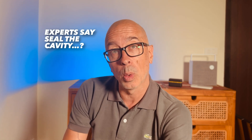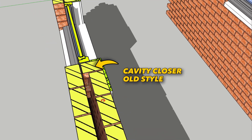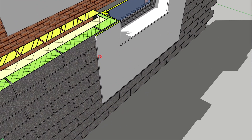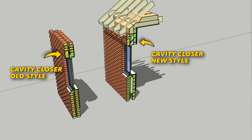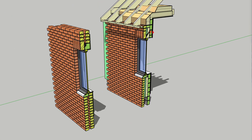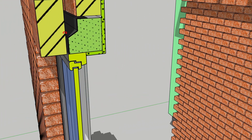The first issue is when you put a window, door, or any opening into a cavity wall — you have to close your cavity and add a cavity tray. You do this to make a moisture block between the inner and outer side, along with some rigid insulation, otherwise you've got a horrible cold bridge. You're going to get mould and damp, and that's what so much of the housing built in the 60s, 70s and 80s is suffering from.